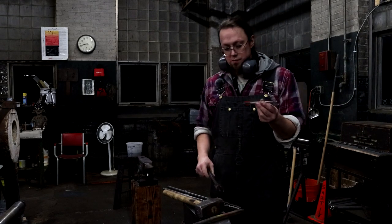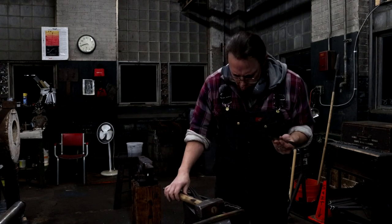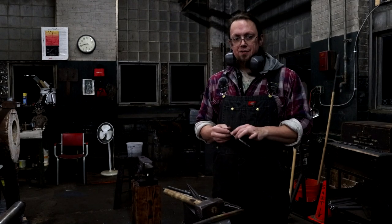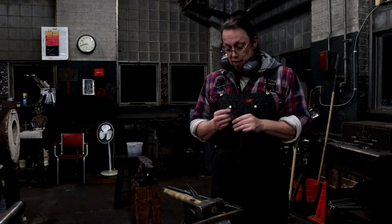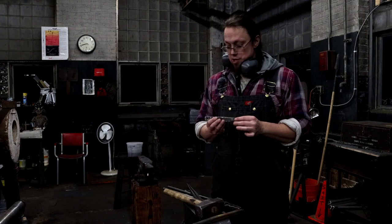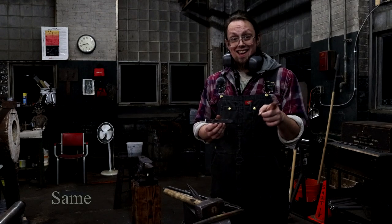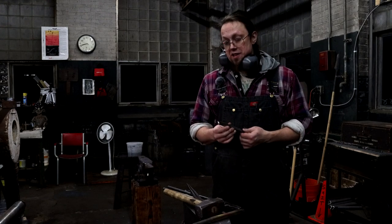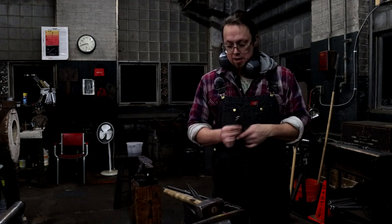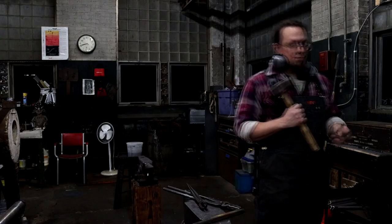These chisels especially, all the high carbon ones that I make from here on out, this is D2, as I've said 1,000 times, because I'm in love with the metal for hot cut chisels. It's very, very fragile, it's brittle. No matter what you do, almost no matter how you temper it, it doesn't want to get soft in any way, shape, or form. So when you hit it with a hard-faced hammer, chips and cracks and things pop off and you're just breaking the thing. But as long as you're using a soft hammer, no damage will ever happen to the back. Not none, but much less.